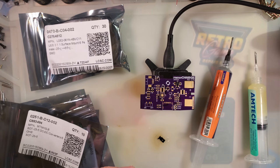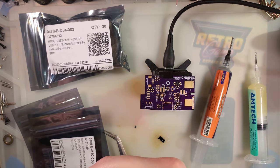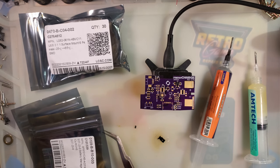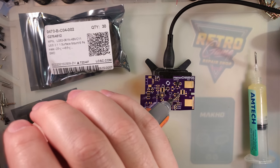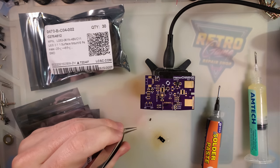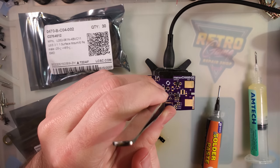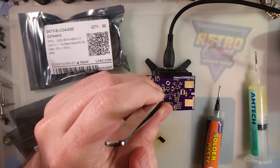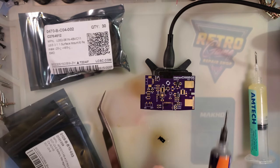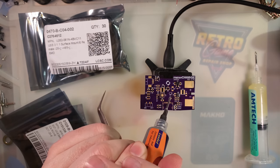Now, when assembling PCBs and such, my go-to strategy is to do all of the small parts first, because working around the big parts is a pain in the butt. But unfortunately, in this case, with so many different things on the bill of materials, it's more difficult to just get everything on the board. But a hot plate and solder paste make my working around tall components excuse pretty flimsy. You certainly don't need to do that.